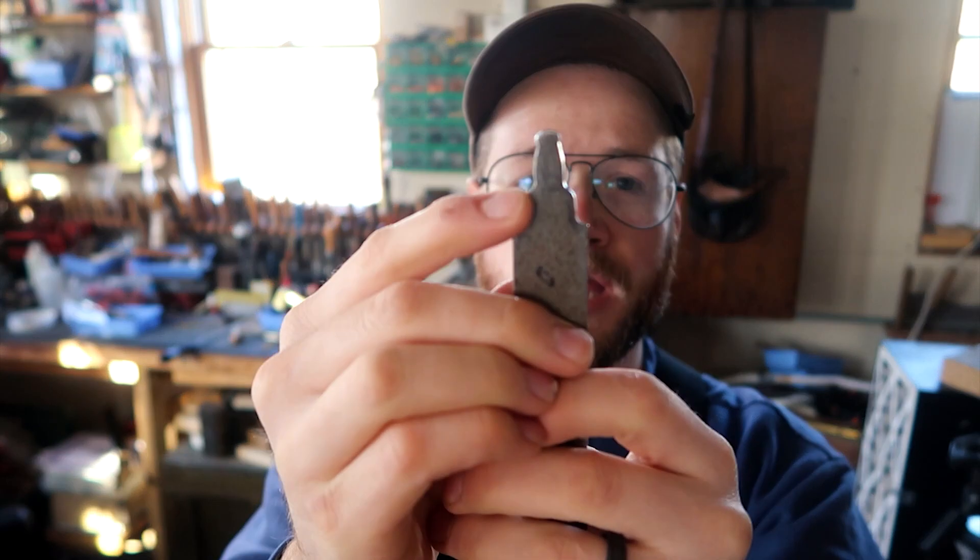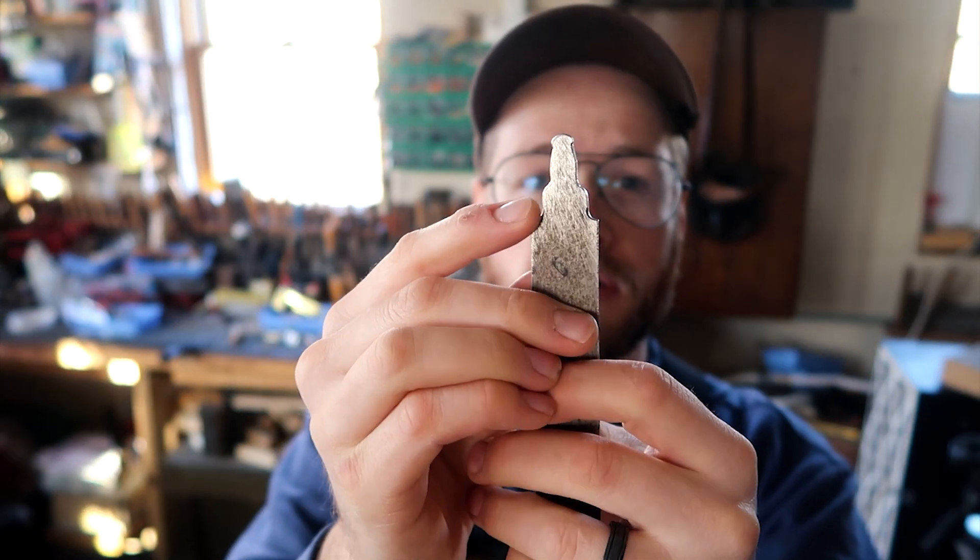When you're filing something like this, the tip or trick that I was given is to file the edges at an angle so that the top or face that's going to be seen has an angle going in and down along these edges. This makes sure that when we mark or scribe the stock for our inletting, our inlet is going to be thinner than our material. That way we can expand the inlet slowly and have a tighter, cleaner inlet — we aren't having large gaps that we need to go in and fill.